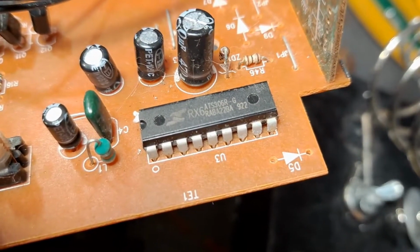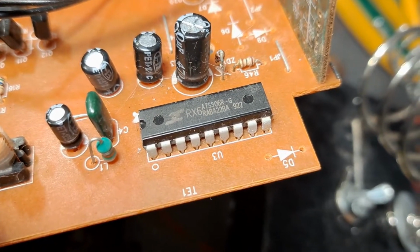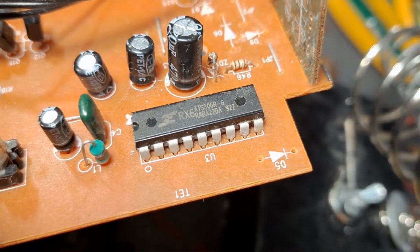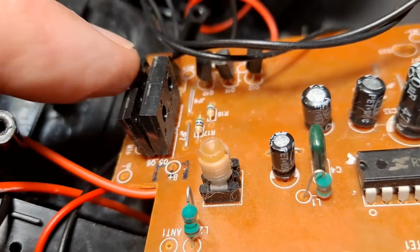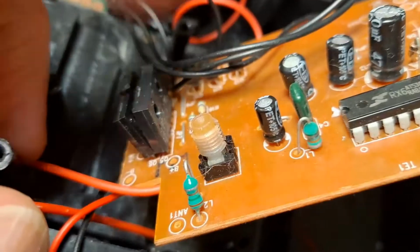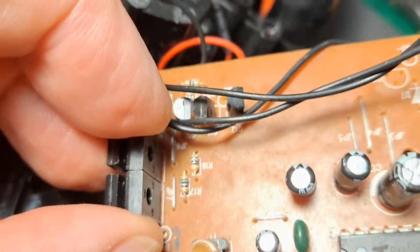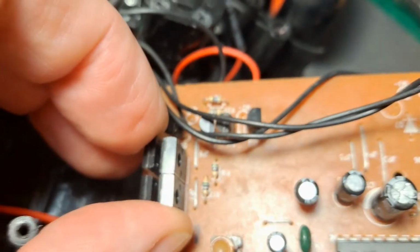Just while I've got this apart, we'll have a quick look at the receiver. That's labelled RX6 ATS 306R RABA22BA. Okay. Anything else interesting on there? Those 4 will be the H bridge for the drive motor. And those 3 must be, oh, there's the 4th one underneath the wires. Those 4 will be the H bridge.